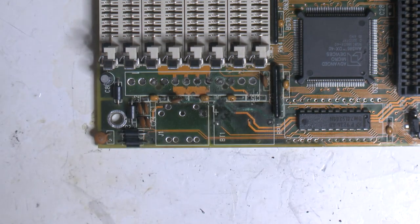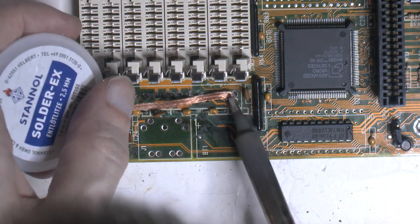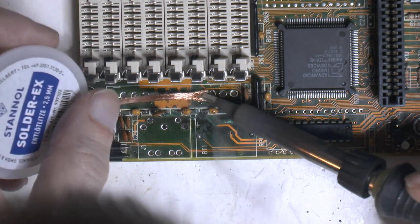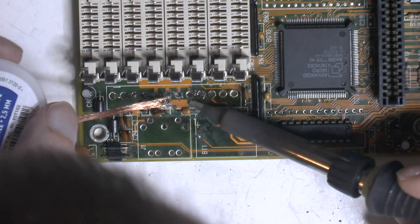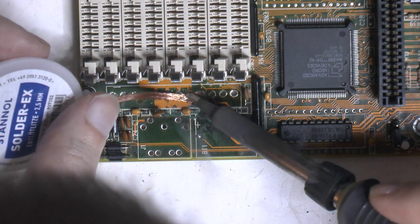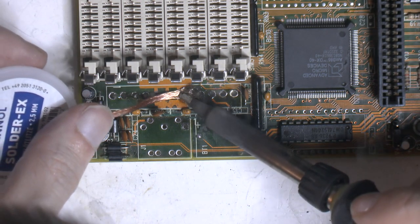So I wanted to get this off because of the corrosion under here. We can clean this up. The problem with corrosion is it's so hard to solder, because the tin doesn't melt and so on. Everything is just annoying. Quite the opposite of soldering, say, a new PCB where you got a kit or something where everything just works. Corrosion really makes everything a pain.